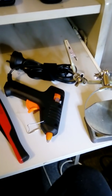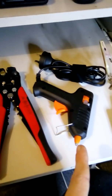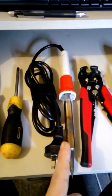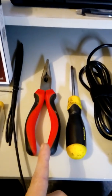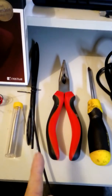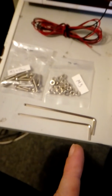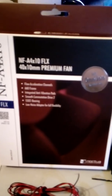Tools required for this process: a soldering third hand, hot glue gun for the thermistor connection, wire strippers, soldering iron, Phillips screwdriver, pointy nose pliers (more so for the cutters), heat shrink, solder, Allen keys, M3 by 15mm bolts, M3 nuts, some spare wire, and a Noctua NF-A4x10 12 volt fan.